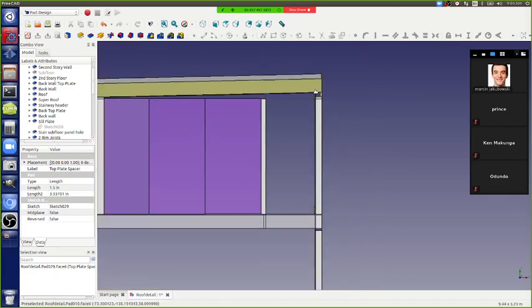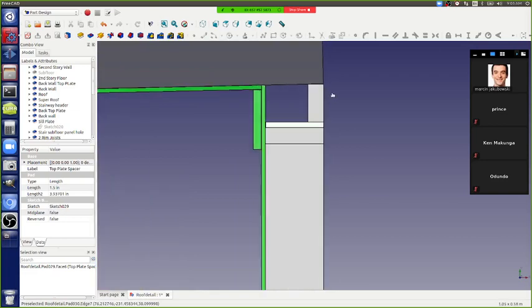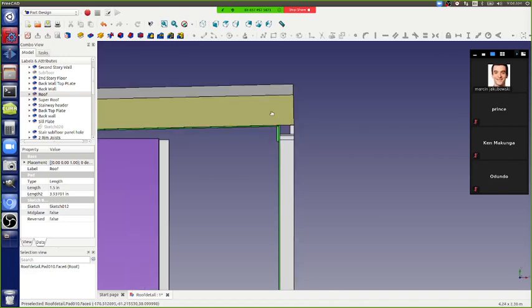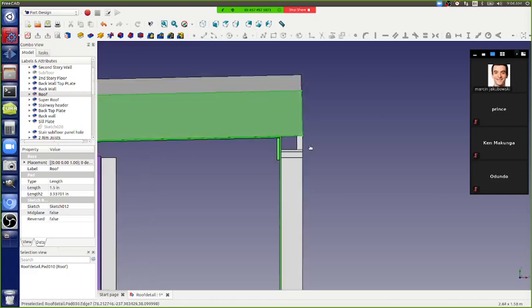But the thing of interest for the complete model, for the structural, is we want to show this detail. Let's keep leaving the box in the XY plane. Let's not tilt it yet until we have the details, like all the blocking in there, because then we're going to have to be tilting everything one by one. So let's just create everything in a flat plane. We'll put that all into one document and then we'll tilt it, because otherwise you'd be tilting all the individual pieces. So keep working on an XY plane on this.